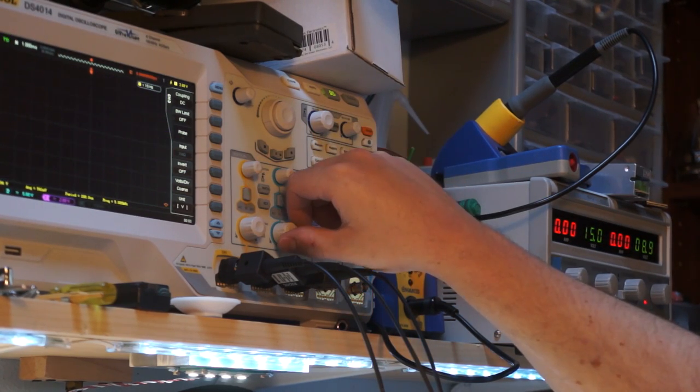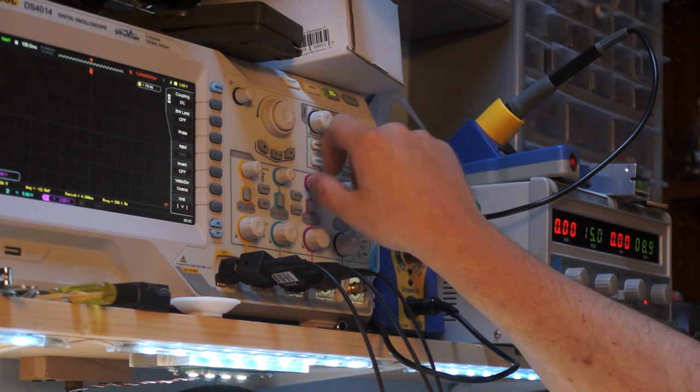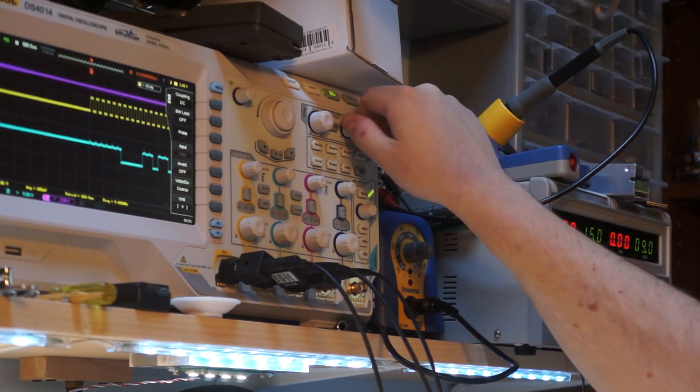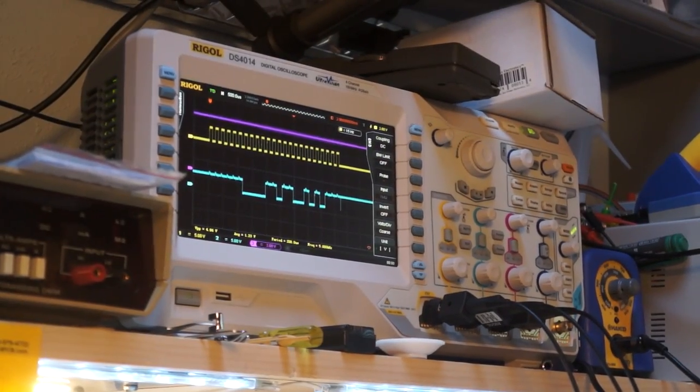So where is whatever's going on... So I definitely saw something on the purple trace, which I thought was chip select. I don't know what the deuce that is. Anyways, this may just use a long quiescent period as basically the chip select. So if we ignore, so ignore all of the crap on the blue trace, because that's just because I'm only using the ground clip on one scope lead.